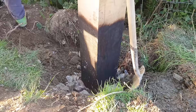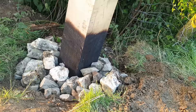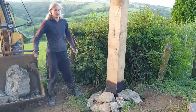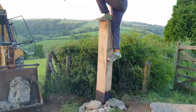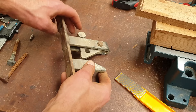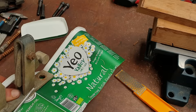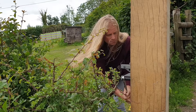After plenty of hydraulic fettling and fixer-uppery we've got the old JCB going — that'll probably be a subject of a different video — but it's extremely useful for digging the holes and delivering stones. When you get to the top, here comes the tricky bit: as you try and arrange flat, long, big stones to cast the water away from the hole, it's kind of like slates on a roof. Ideally these big stones right at the top should also be preventing plant growth and all other organics rubbing on the gate post and imparting moisture, bugs, and other stuff — and again should prevent decay a little bit.